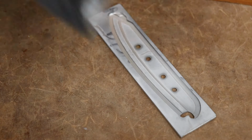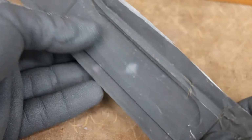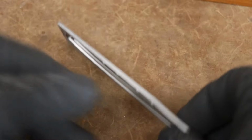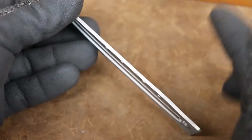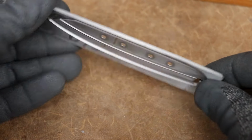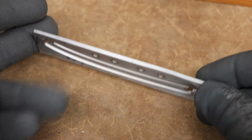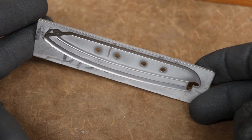And the cause for that, I should have thought about this, is that the pack, after getting really hot and then you cool it down really fast, creates a vacuum inside, and so the two sides of it suck down. Because I had these stacked, which I never should have done, I've never tried that before, it sucked in the two sides and just potato chipped both of them in opposite directions. So that was kind of dumb, but won't be doing that again. I'll just do another one of these. I don't think I can save this one. I'll just do another one in a single pack, and we'll try that. At least we know the hardness is right, so that recipe works.